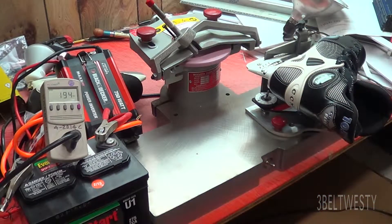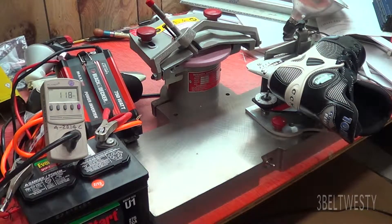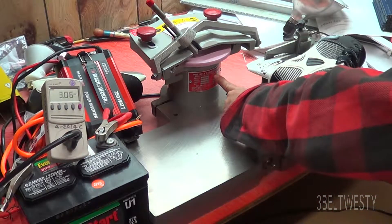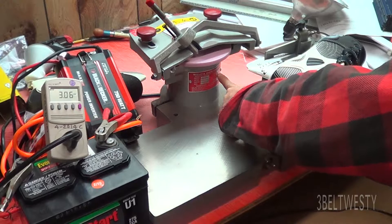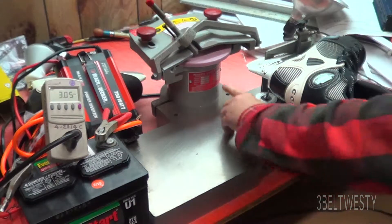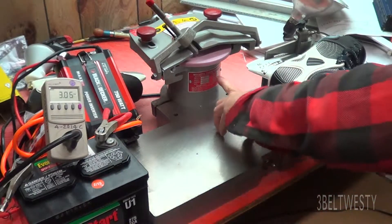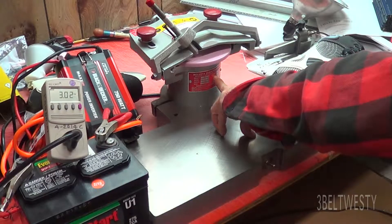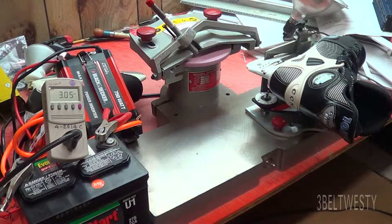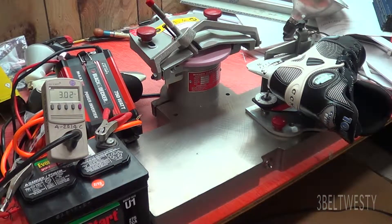The intent was to see if I could run this off a car battery, which seems like it'll work. It's probably a quarter horsepower motor, drawing about 3 amps running. Generally a motor like this, when it starts, it's going to draw probably five times the amps instantaneously, so you're going to draw 15 amps — that's why the starting is kind of hokey.